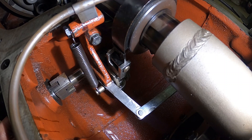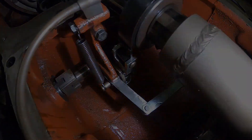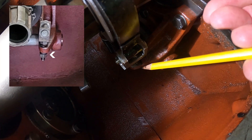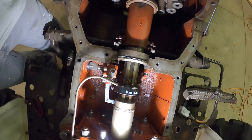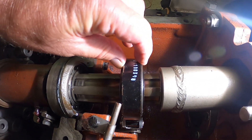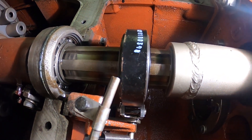Now holding it locked in, we go up here to the actual band brake. You should have a little bit of movement in there, which we do — it's just a little loose. If it was really loose or tight and didn't move at all, you would adjust over here on the other side. There's a stud that runs through this apparatus, and at the bottom there are a couple of nuts including a jam nut, so you can adjust this — you can lengthen or shorten it to tighten the band brake, and then lock the jam nut in. That's basically how the band brake system is adjusted. Then of course you remove your feeler gauge, and it's spring loaded to release. When you apply the clutch, it tightens up — which it has now because I'm operating the lever.